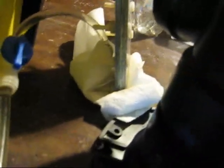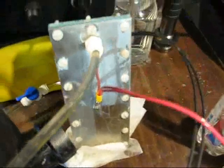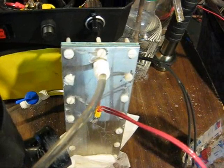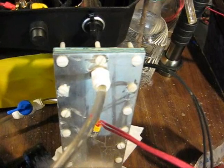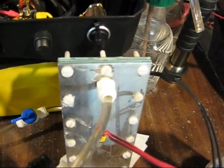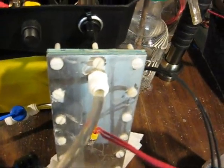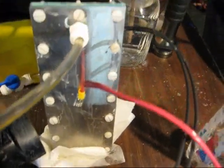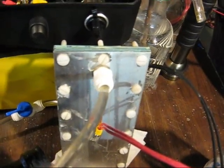I've got another valve that goes into the bottom of my cell. The cell is made up of 6 stainless steel plates of 4 inches by 10 inches. They are spaced by gasket material that is 15 thousandths of an inch thick, and I'm currently using quarter-inch nylon bolts — 16 of them around the outside edge to hold the cell together.